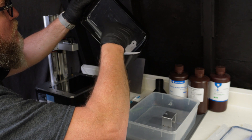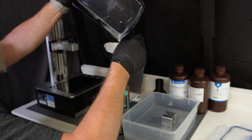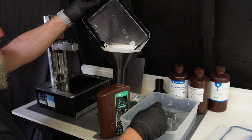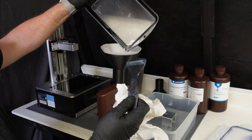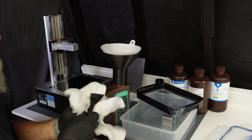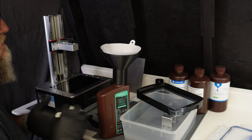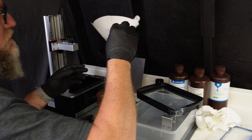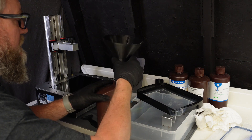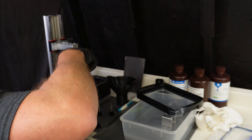Here's a different funnel — I'll have a link for one that fits Anycubic and Elegoo bottles. Pour the resin in and take a close look — you can see sludge in the bottom of the resin. It's not stuck to the FEP, just bits of cured resin sitting in the vat. They're not big enough to get stuck between the build plate and the FEP and crack your screen, but they can float around and act like a mask. If you have bits of cured resin in your vat when you go to print, they will put holes in your print — so it's worth cleaning out periodically.